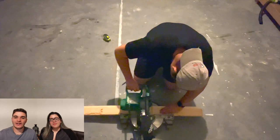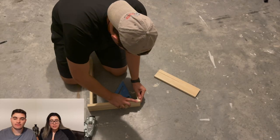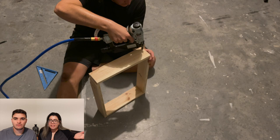We decided to go for two different looks in each bathroom. For the guest bathroom, since it's always pretty empty and we don't really use it, we decided to go with an open concept and take away the door altogether. We cut the 1x4x8s using our miter saw, which will be linked below. We cut two 14-inch pieces, two 18-inch pieces, and then we cut a 12.5-inch piece that was going to be the shelf. Once everything was cut to size, it was time to build the frame. We did this using our nail gun, which will be linked below, and our trusty square.